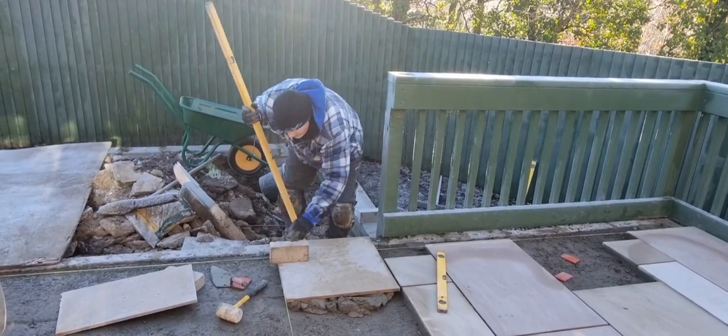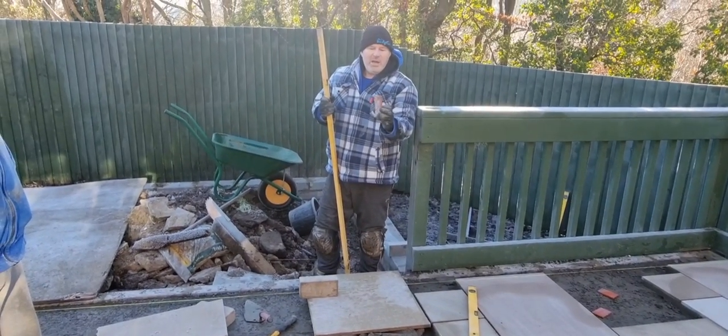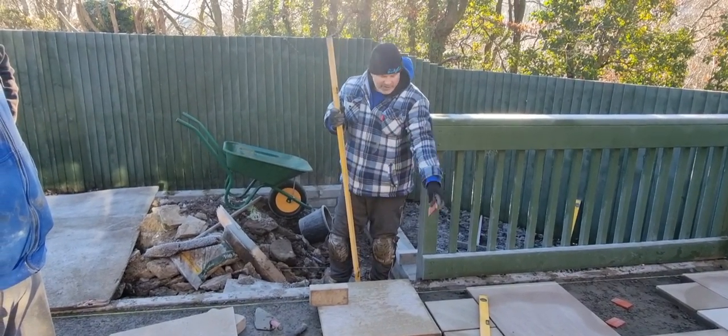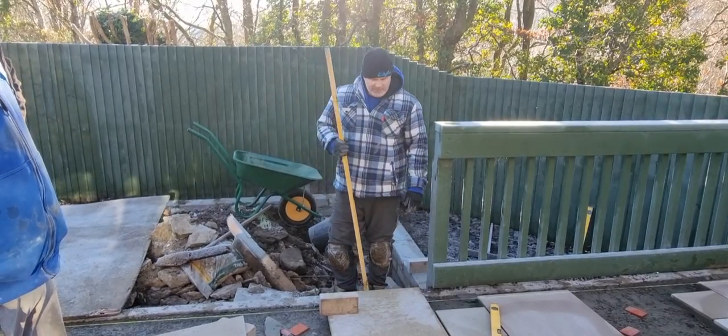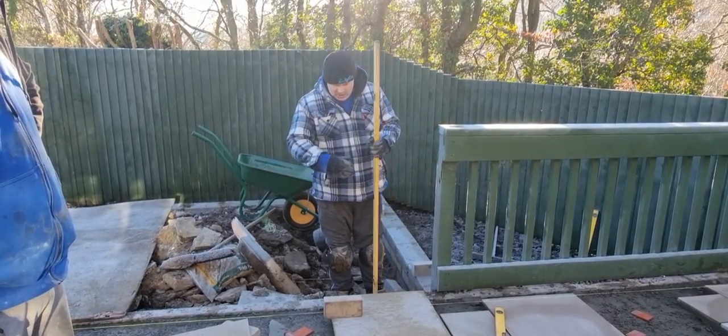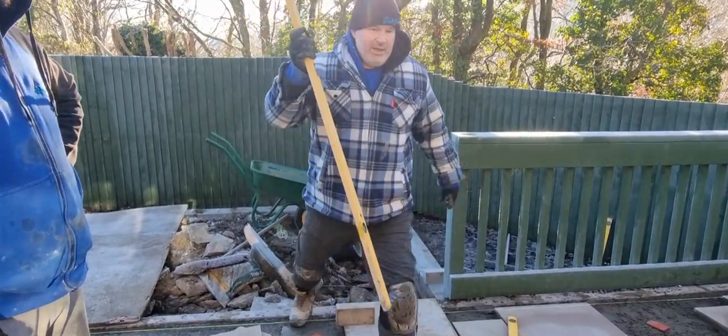put your spaces in. We haven't got any spacers, couldn't find any 10 mil spacers anywhere, so we're bricklayers, so we got 10 mil weep holes off the van. We just put them in there for your 10 mil. There's your 10 mil spacer. Do that on every one. So now we pull in a string line from here, and this is set in stone